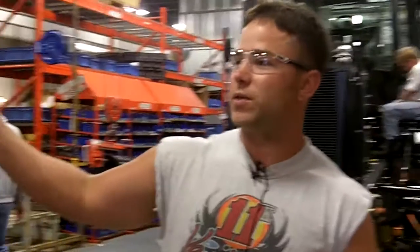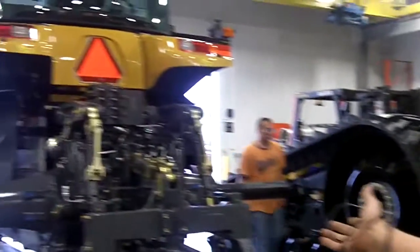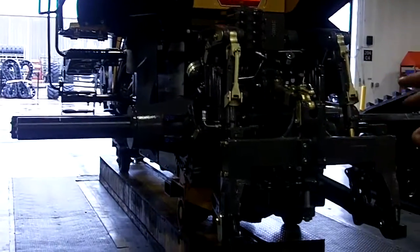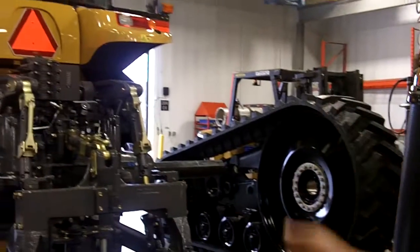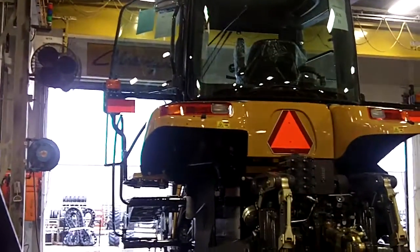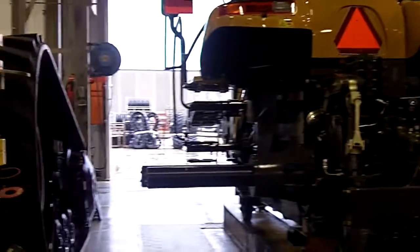This one's ready for a hood — they'll put the hood on it. Then it'll come down here to the lift, go on the lift, get raised up, and they'll put the tracks on. They have two special forklifts that go into the tracks, pick the track up, and the tracks will go on to whatever spec they are and torque down. Then that'll drop down into a pit, the tractor will be set on the ground, and they'll drive it ahead. If there are any undercarriage weights or belly pans to tighten up after that, they'll do that then.